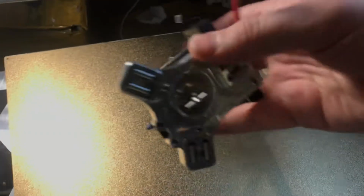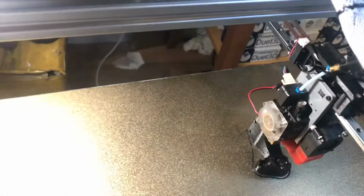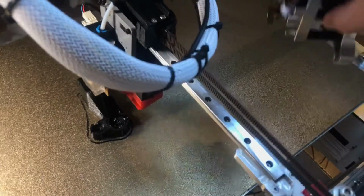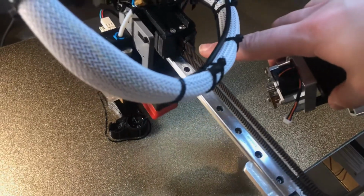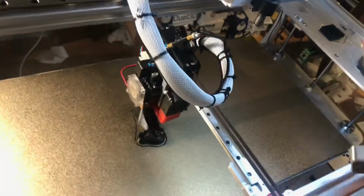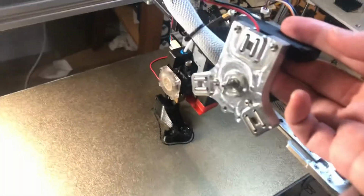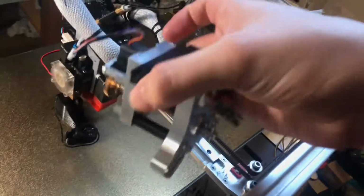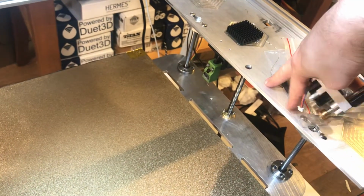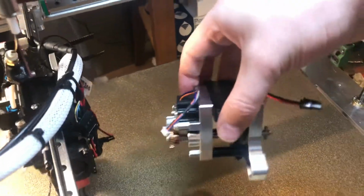Has to do with the E3D tool changer, which of course we have retrofitted so that it can use the larger MGN12 carriage featured here. This larger size, meaning it's a 12mm rail instead of the 9 or whatever it was originally intended for. That was really just a little too weak for what we saw we needed. So this allows tool changing, where tools will be presented here or mounted here in various ways with the corresponding adapters connected here to park them. And this, of course, actuator allows you to come pick up the next tool.